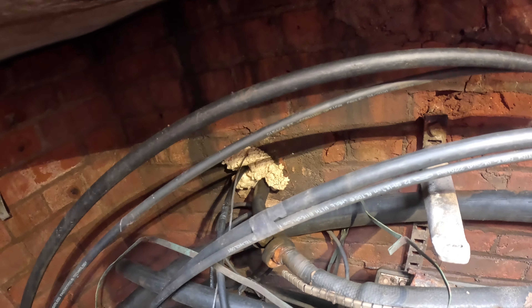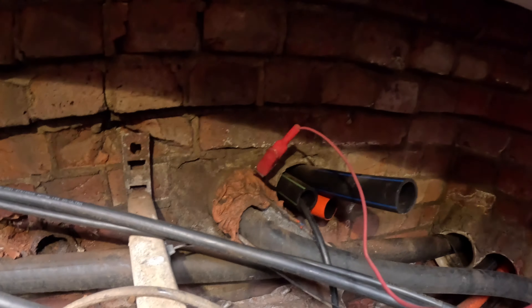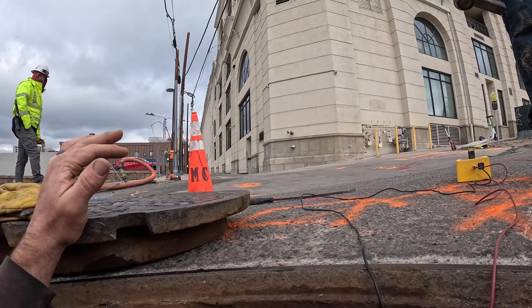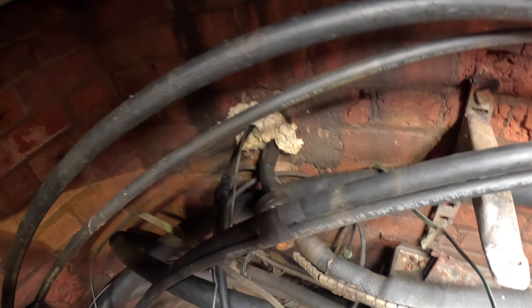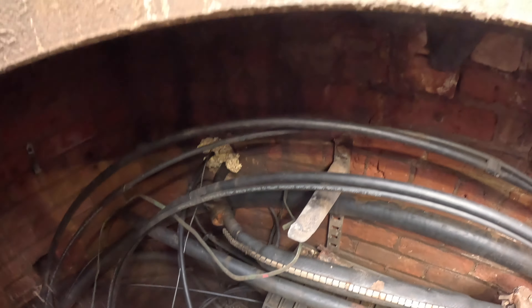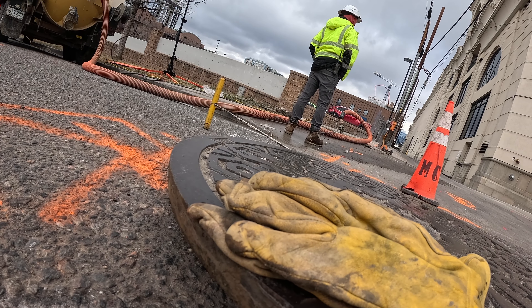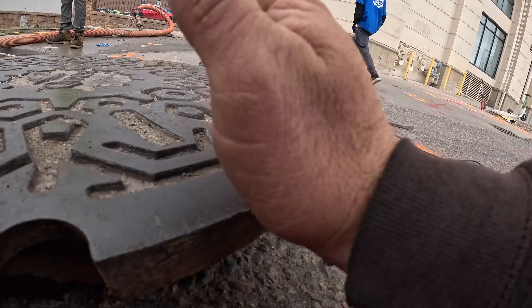See that — we found those going out that way, and we found those going out right here. Now we want a few more potholes to do and then maybe we can drill. But this one right here — see the big cable? That is copper, a copper line. This is fiber right here. And whoever set the boxes over here intercepted the duct that the copper line was in and pushed their cable through — that is absolutely not cool.